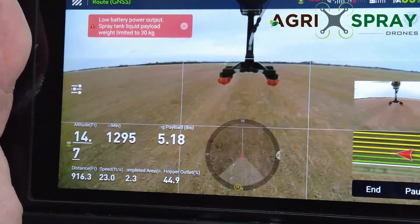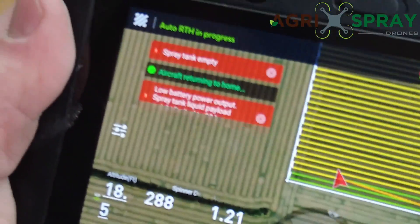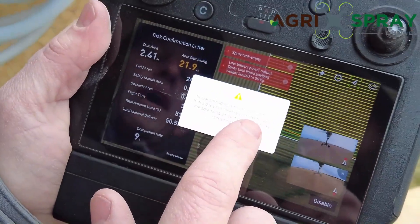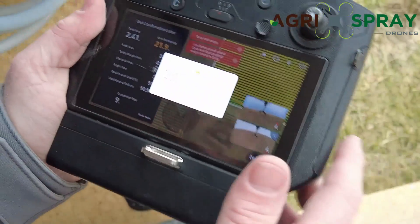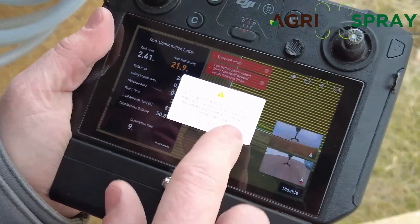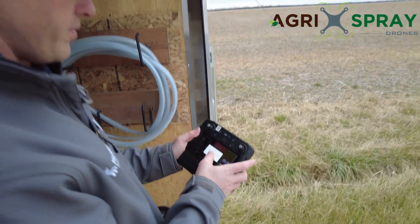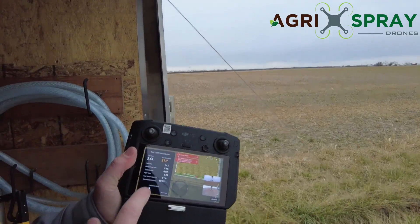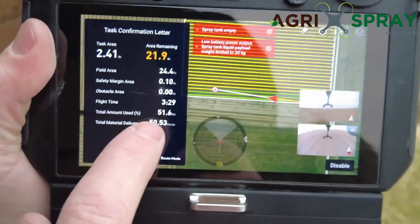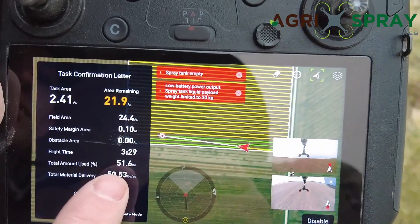The granular spreader can dump that full tank in right about a minute at 100% opening. So if you wanted to put out a lot of product, you could do that. We have just about two pounds left and the app says our spray tank is empty, so the drone is going to turn around and come back home. It told us that our actual amount spread was 21 pounds to the acre. It doesn't meet our requirements, but that's because we changed a bunch of stuff while we were spreading. If you get this message — if you had it set to 15 pounds to the acre and it tells you it actually put on 21 — then you know you need to reduce your target rate to get your actual rate where you want it. It also tells us how much area we spread, how much area is remaining, and how many pounds total were used. It's extremely accurate — those bags weigh right at 52 pounds, it says 51.6, and we spilled some in the trailer, so that scale is really accurate.